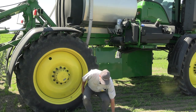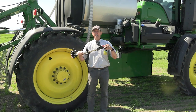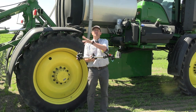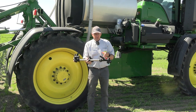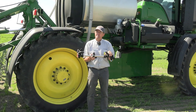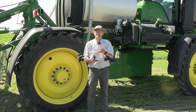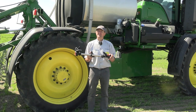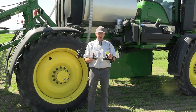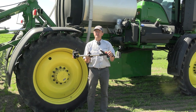During the presentation, Tom showed a kit from Wilger Industries in Saskatoon, which makes components that help you convert your boom to a recirculating boom. The recirculating boom keeps product flowing with no dead ends — even when not spraying, it can pump through the boom and back to the tank. It makes air purging easy, you don't waste product, you can water rinse and push it back to the tank. If you don't have a recirculating boom, you can get a kit from places like Nozzle Ninja in Stettler, or build one yourself with these components.